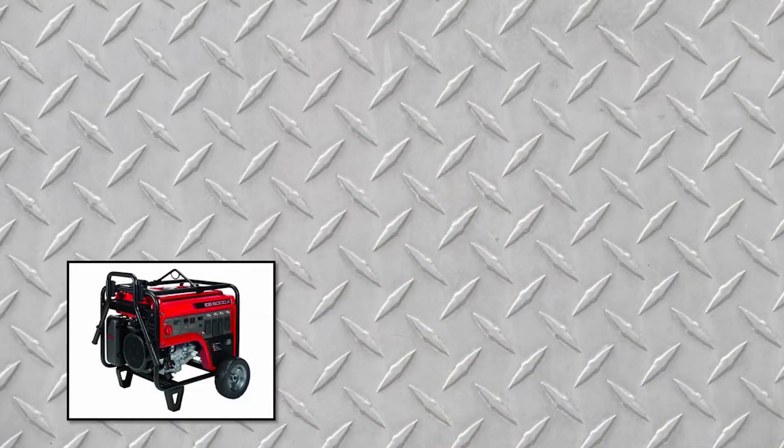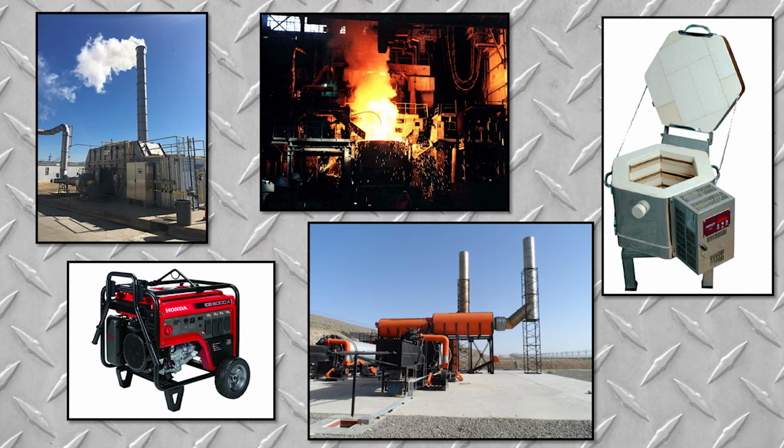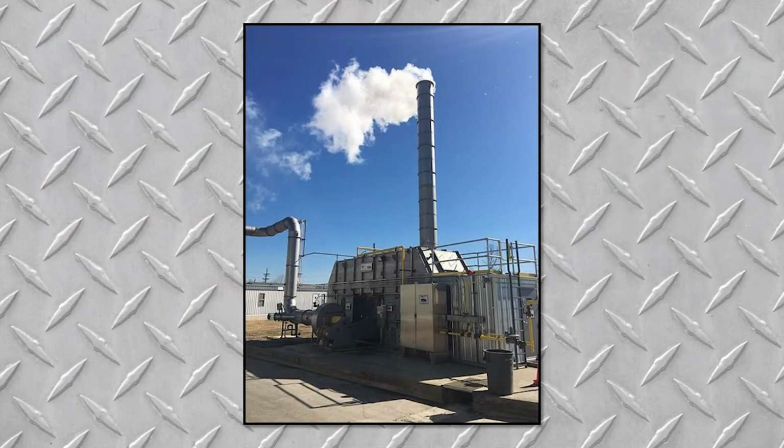High quality waste heat is considered anything over 1,000 degrees Fahrenheit. You can get that quality of waste heat off of systems such as power equipment, melting, kilns, incinerators, and especially thermal oxidizers. Thermal oxidizers are part of an exhaust system that destroy chemicals coming out of, let's say, a printing process, and have some of the hottest temperatures I've ever seen. There's a fun story where we stuck a thermocouple into a thermal oxidizer port and it came back melted. So instead of a temperature, we just wrote "wicked hot," and that has become a technical term in my shop.